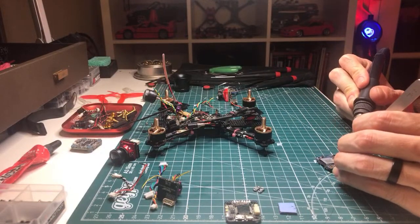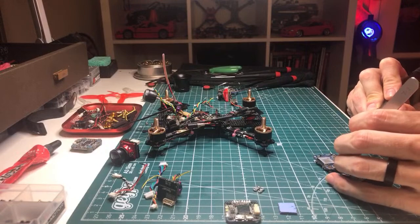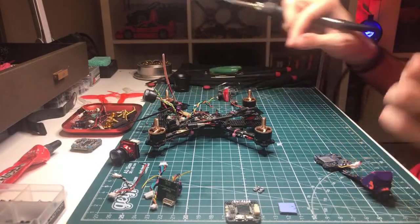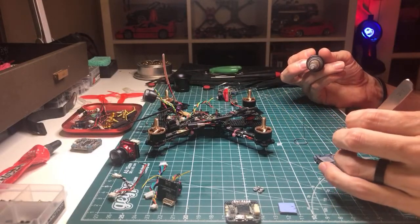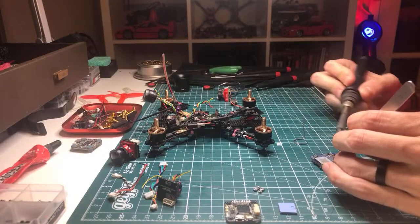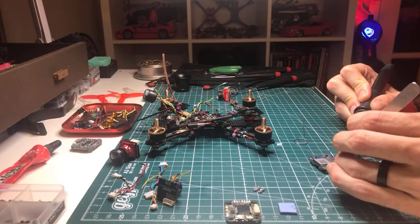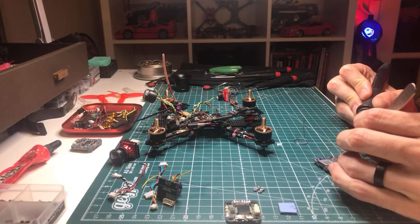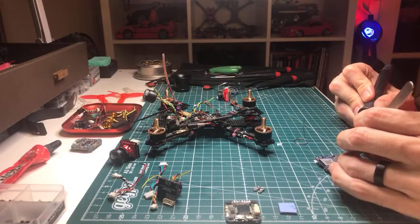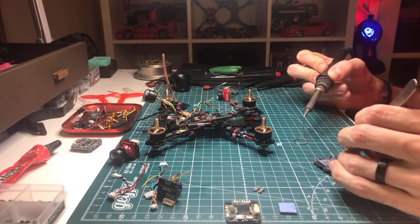I am going to... Well, you know, I should explain what I'm doing, because this is an FPV live stream, right? With 17 people that build these things watching. My builds take a long time. I get poked fun at for how long it takes me to get builds done. But the reason why is micros suck to build, and you have to find every millimeter of free space that you can with them. Specifically, I really try to drop the stacks down as low as possible to bring the battery down as close to the prop line as possible.